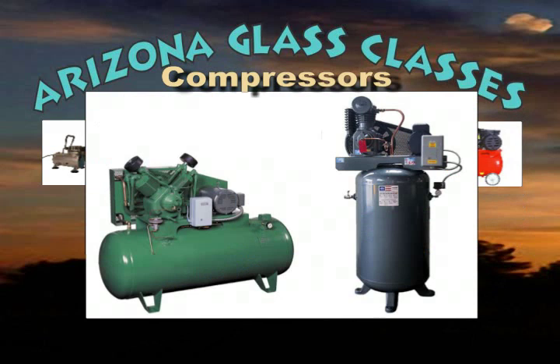Larger vertical or horizontal tank compressors will meet your requirements well. Remember it's not the size of the tank that counts — it's the volume of air that the compressor itself can output. The tank only stores a given volume of air in reserve. At some point the tank will drain enough to trigger the compressor to start, and if the compressor cannot keep up with the airflow requirements of your sandblasting nozzle and pressure pot settings, you will have to stop periodically to let the compressor catch up.